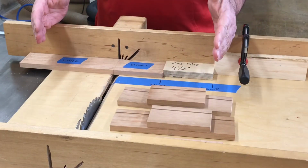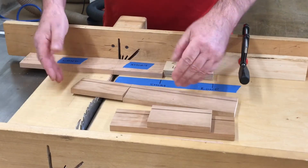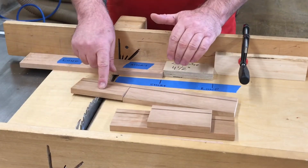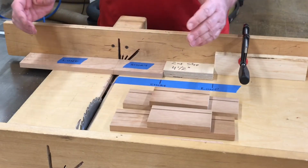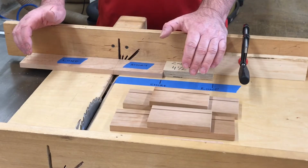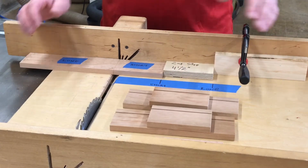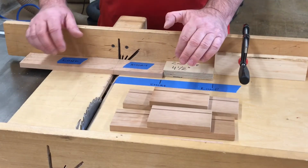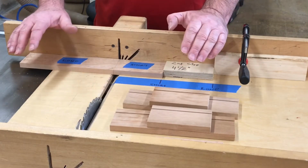What I typically do is I'll cut a piece about 1 inch longer than both of those together, so when I cut it, I'll have the grain running from one to the other, so it's nice to be able to do that. But how do you set up a stop block to do both of those? Because doing a run of these and then resetting the stop block for the other, you actually get the parts mixed up and it becomes a logistical nightmare.